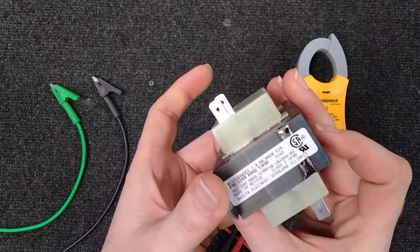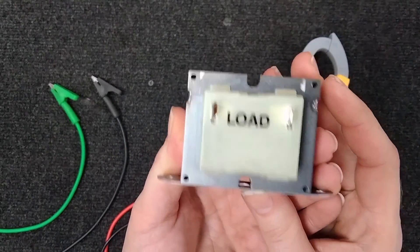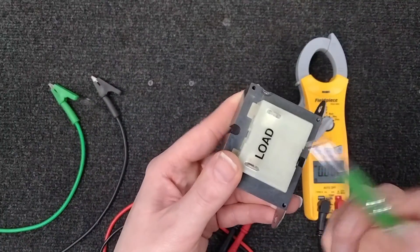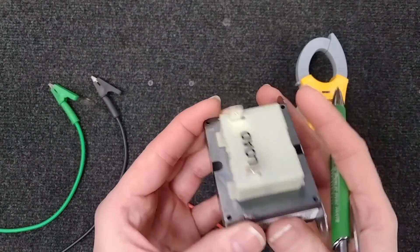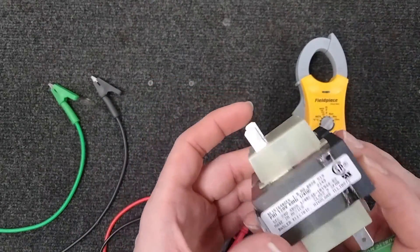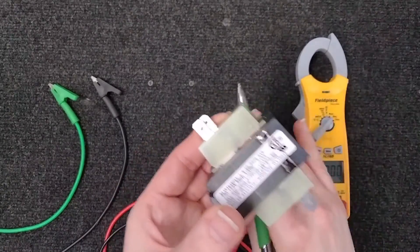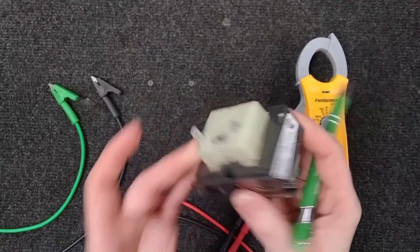So how do we know if it's good or bad? Well, a lot of times if you can just remove this from the unit and you see a big dark spot right here — normally it's on your low side voltage, which is the 24-volt side — and if you're smelling something really chemically burned, we all know that smell, but it's usually bad. Another common indicator that the transformer is bad is if your indoor heating unit and your outdoor air conditioning unit is not coming on — nothing, no lights on your control board, the blower doesn't come on, any of that. This can be a culprit.